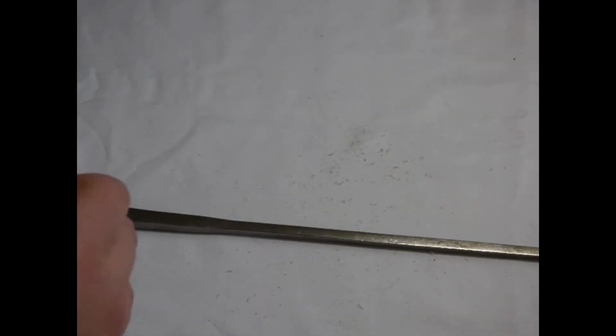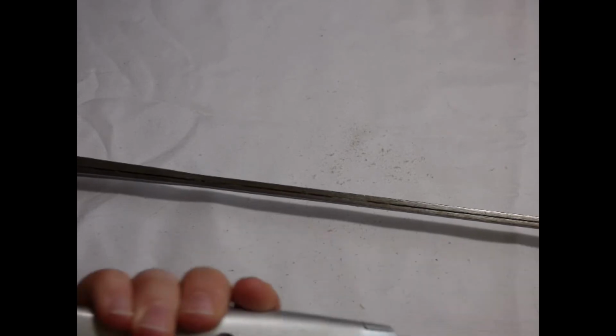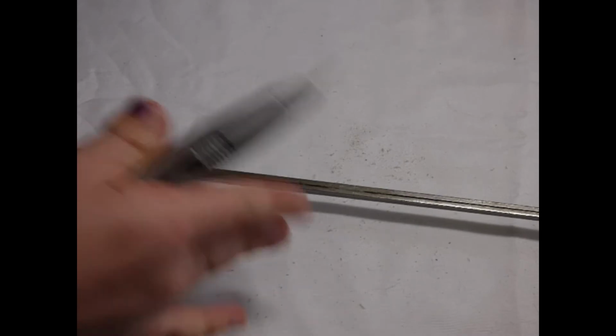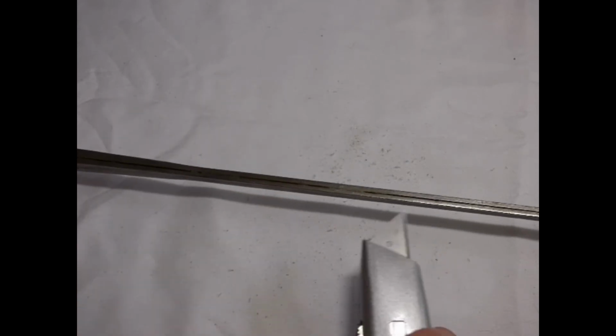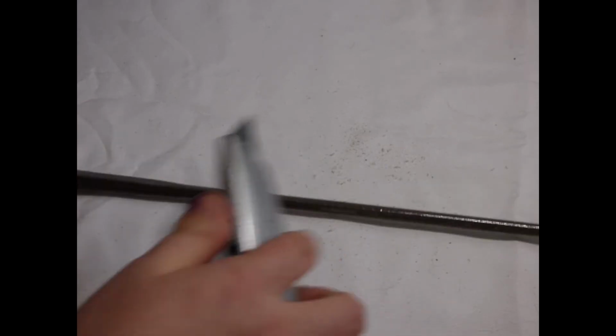Once the wire has been completely removed, wipe the blade down with the towel using some acetone. Then take your knife and start scraping the glue out of the groove. Take your time to be careful for your own safety and always make sure the blade is pointed away from you. You'll also likely need to make a few passes to make sure it's as clean as possible.